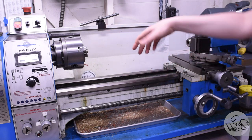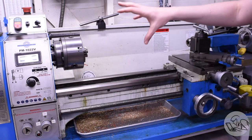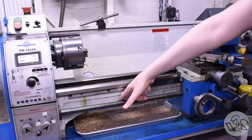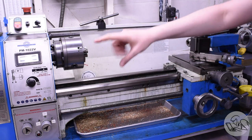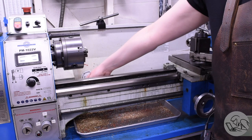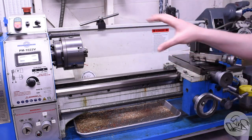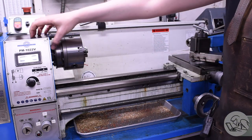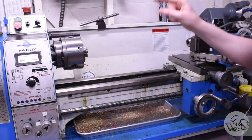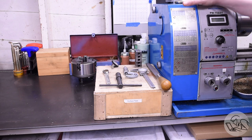For example, on this machine, when you're lifting it from here, the machine will look like it's top heavy and you might think it's going to roll. But it isn't, because most of the mass of the machine is the DC motor, which is way down low in that corner. You might not know that just by looking at the machine. So follow the people that know what they're doing — that's the manufacturer. Before you lift anything, you've got to have a plan for where you're going with it. You really only want to do that lift once, so think about where it's going to go on the bench.